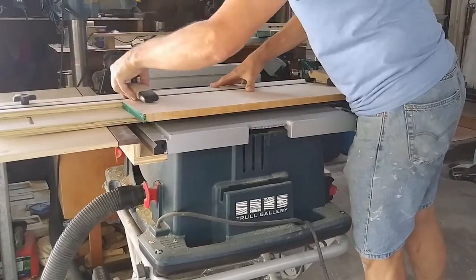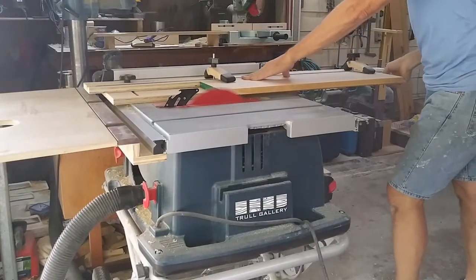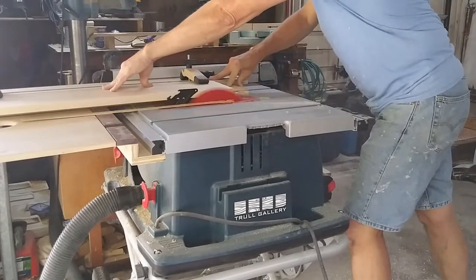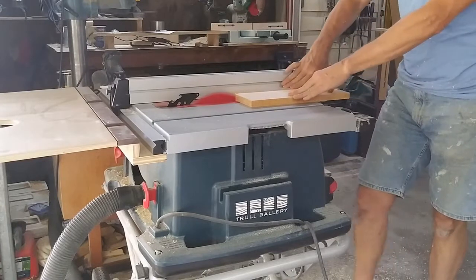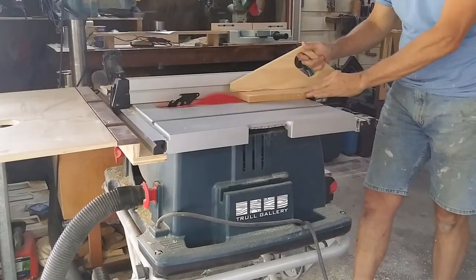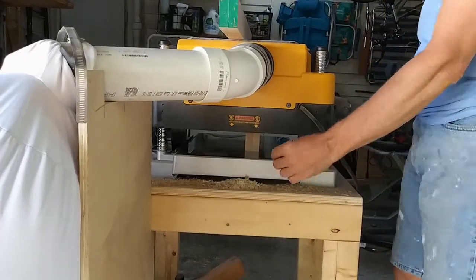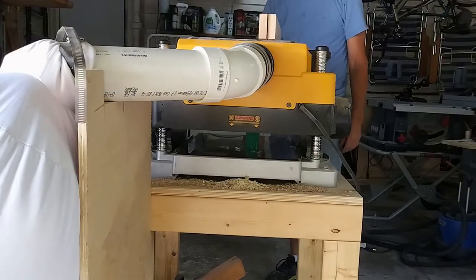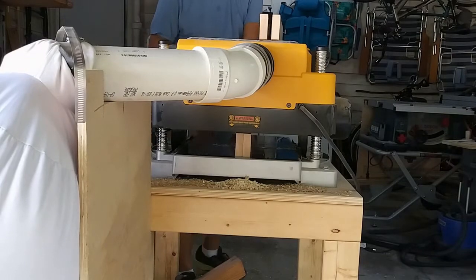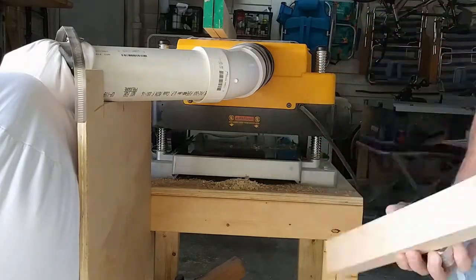Since I don't currently have a jointer, I put my stock in a straight line jig and ripped one edge straight. I got the plans for this jig from Fisher Shop — I'll leave a link below. Once I had one edge straight and 90 degrees to the face, I removed the straight line jig, adjusted my fence, and cut my stock to width — just over my final width, in this case about 2 and 5/16 inches. I took my stock back to the planer and cleaned up the saw marks on the edges with a few light passes and brought them to their final width of 2 and a quarter inches. This has rarely caused an issue for me, and it saves a ton of sanding.